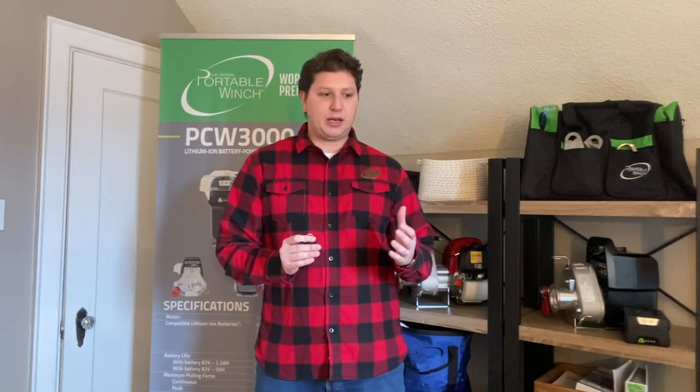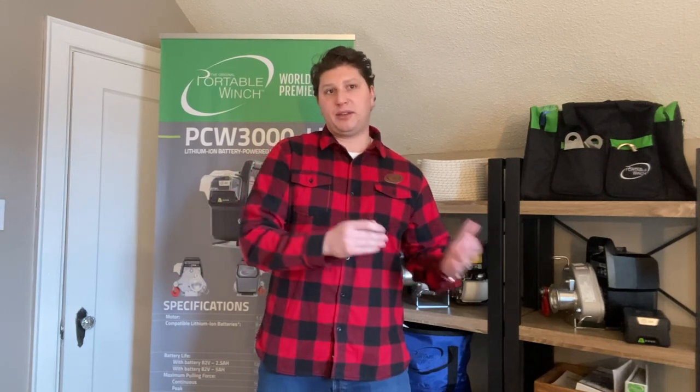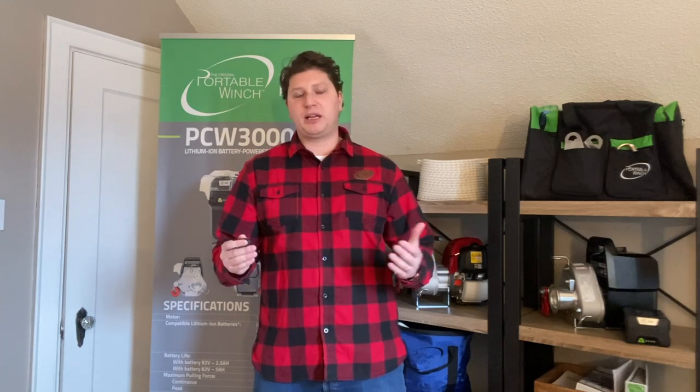First of all, if you're thinking about using the PCW3000Li, our battery-powered unit, it works pretty well in cold temperature. The only thing you need to consider is the batteries. Upon the tests that we have done, below -14 degrees Celsius, which I guess is close to 0 Fahrenheit, the batteries will be too cold and may not communicate with the controller of the winch.